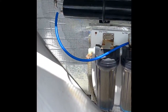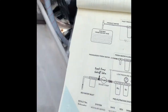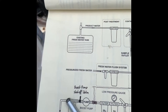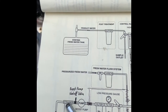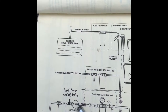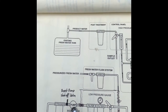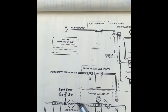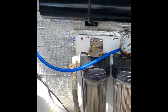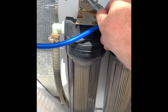I'm sitting here in the front locker and I'll take you through quickly. We have here the sea water inlet through the strainer that is in the master cabin. I installed a shut-off valve — I will show that to you just now. With a booster pump — pump number one — it's supplying salt water through the 20 micron filter, which is this one here.